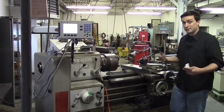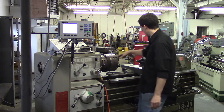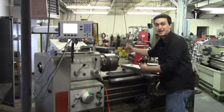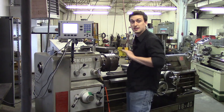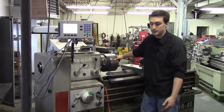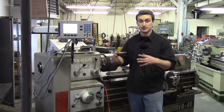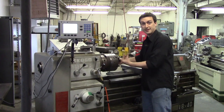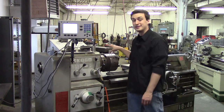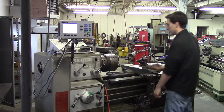I have a few rules I'd like to go over. Before you start running a part, make sure you're clean, lubed up, and good to go. Make sure your tool post is secure and not hanging out further than it needs to — if you only need an inch hanging out, just hang out an inch. Make sure your workpiece is secure; if it's not it could fly out and hurt somebody. Safety is very important — on a lathe everything is in your face. You've got chips flying at you, and if a nest of chips forms and the lathe whips it around it can hit you in the face. I'm going to go over safety precautions and even show you how to make and mount a shield to protect your face.